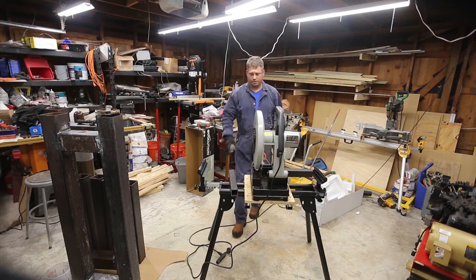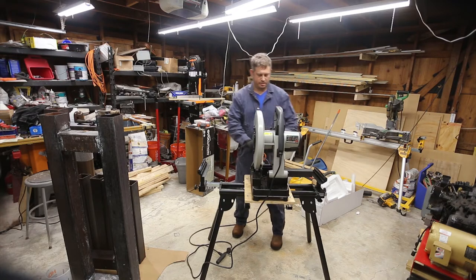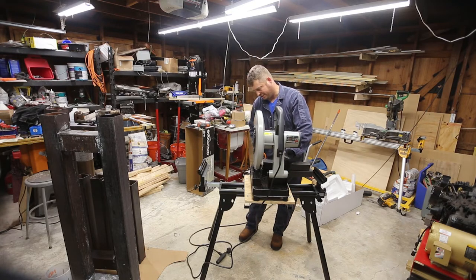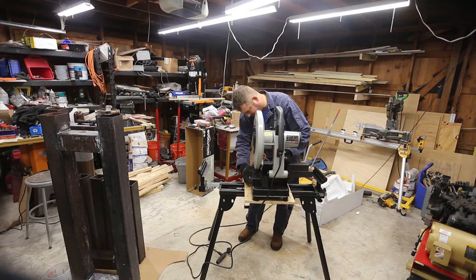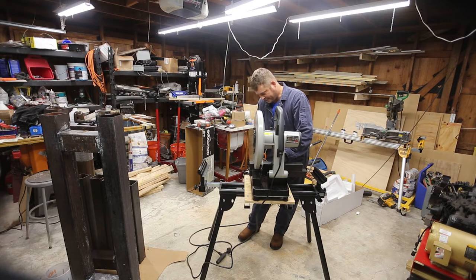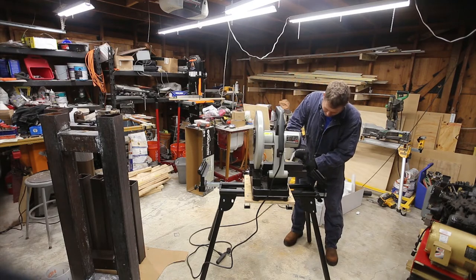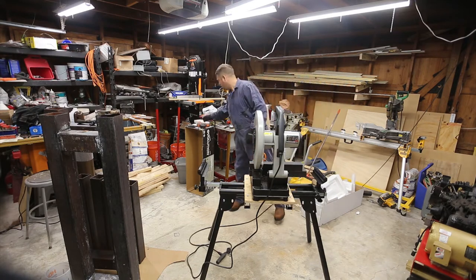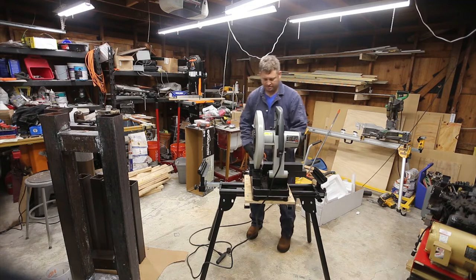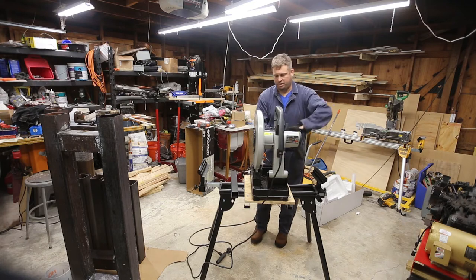All right, so that is 2-inch by 2-inch, 1/8-inch wall mild steel. That's one of my pieces. And so I'm going to cheat. Well, it's not really cheating. I'm going to use one piece to replicate the other. So I'm locking them together, and then I'm going to come down here and just scribe that second piece. Take this and set this to the side, flip this one over.